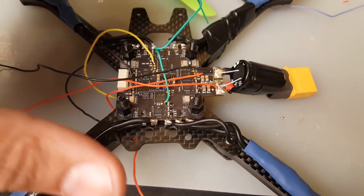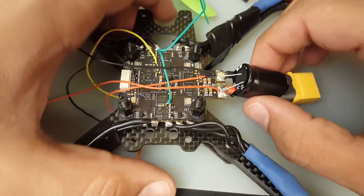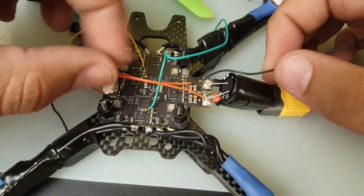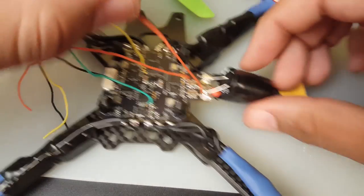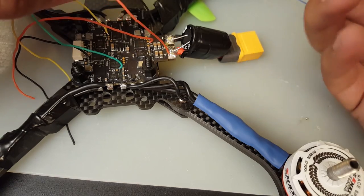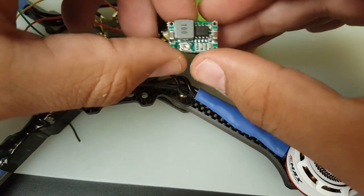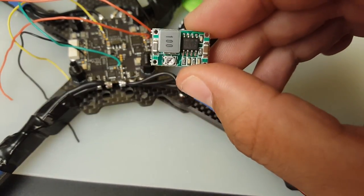The XT60 connector is in with the low-ESR capacitor — it's pretty fat so I got creative and put tape around it. Luckily it's 25V; if it were 35V it would have been much larger. I also took a ground and power lead from the battery. Like in my previous builds, I'm going to use a selectable voltage regulator with a potentiometer. Set it between 8.2 and 8.5 volts — it runs cleanest at that voltage; I've tested it on my oscilloscope.